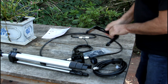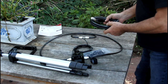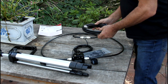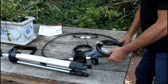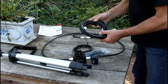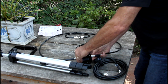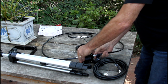What we can do for 20, 40, and 30 meters is to replace the main antenna cable with a larger cable. If we want to use it on 40 or 80, we want to put this in series with the existing loop, making three loops — whereas this alone for 20, 30, and 40 would make two loops. If you do put this in series for enhancement on 40 or performance on 80, it won't tune on 20 or 30.